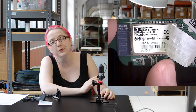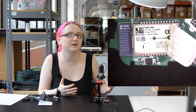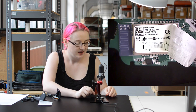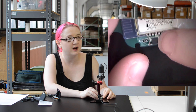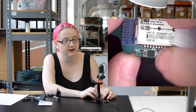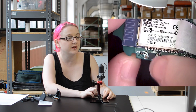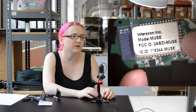That's very interesting, because all the wearables we've looked at so far use Bluetooth Low Energy. If you're not using BLE — using Bluetooth Classic instead — how are they using it with Apple devices? You need certification for that. And when I was looking up the chips and couldn't identify one, it hit me: this is the made-for-iPod or made-for-iOS authorization chip — the MFI chip, part number 337-3959 — the authentication chip that allows this module to talk to iOS.